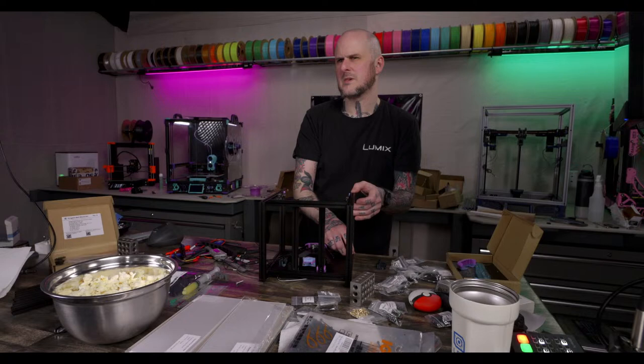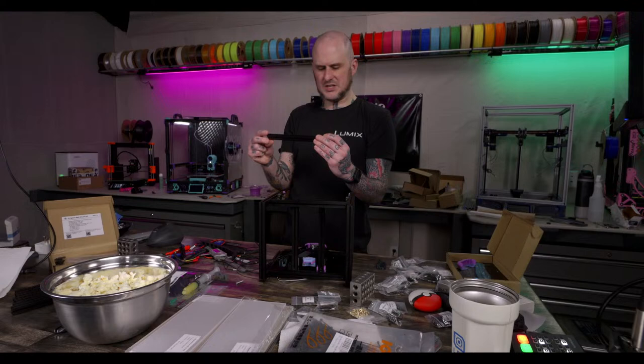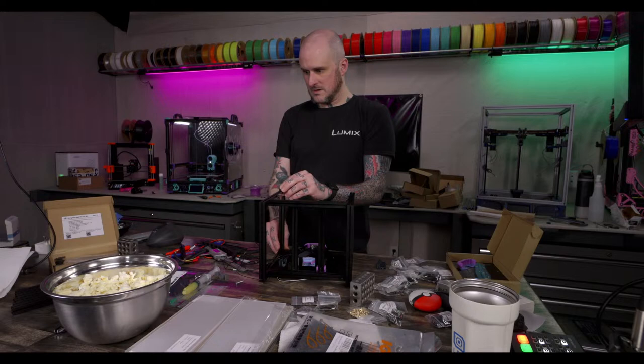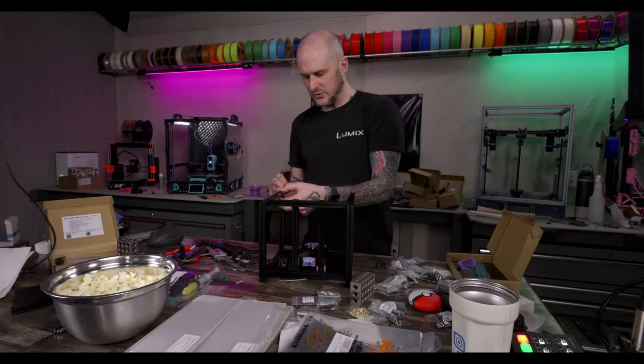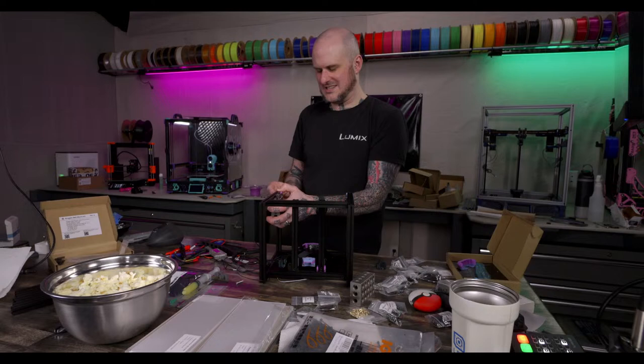My V0 makes music. Well then you should look into... Well, possibly running. I can't run mine Stealth Chop. Or is it my... No, I can't run Stealth Chop on my 2.4. TMC Auto-Tune. Look into TMC Auto-Tune. That really helps with motor noise. Printing 5 to 8K accelerations at 200. Yeah, that's about where mine's at. Mine's just got crunchy noise from the rails. It makes this weird, resonant sound.